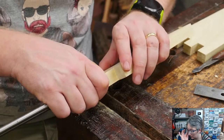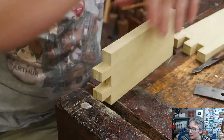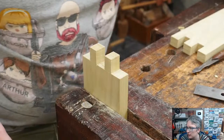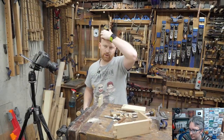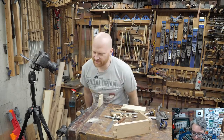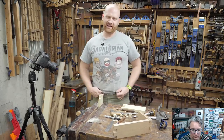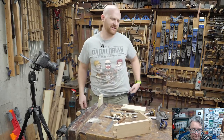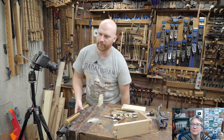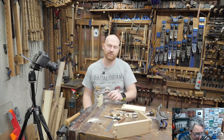Not necessarily related to the topic, but yes. Let's see. Andy Puttbach asks, can James make a regular video on gluing up oily woods like cedar, teak, etc.? Gluing up oily woods. Honestly, there's a lot of myths about gluing oily woods. And really, it doesn't matter. Unless they're going to be in exterior use and always out in the rain. And in that case, your glue is going to be having all sorts of problems to begin with.